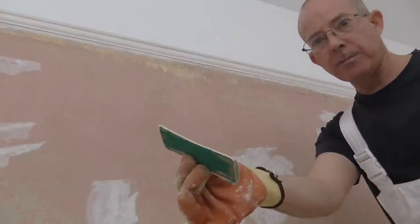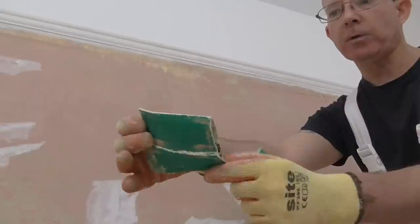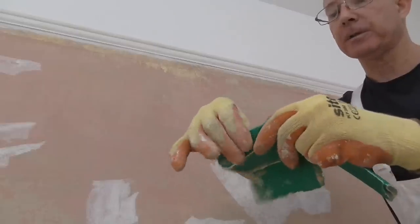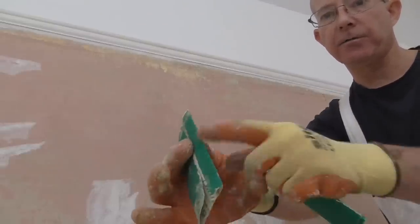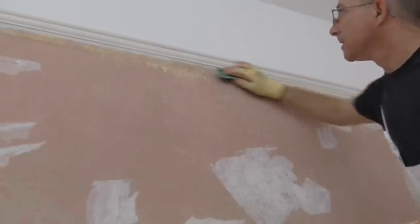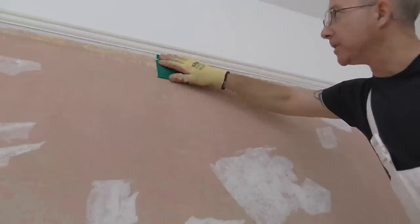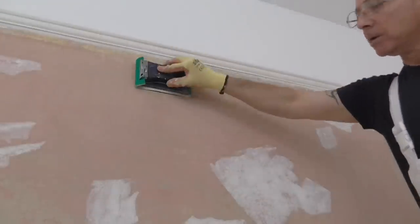I always use a piece of sandpaper and you can see where it has been wearing. Because when it's folding over, I like the sharp edges to get into the corners. So what I do when it starts wearing like that, I'll make another fresh corner and keep working the sandpaper like that until basically there's nothing left in it. So that's the top edge. And then the flat sometimes needs a larger piece of sandpaper — you can have it under the edge there, and then turn to your sanding block to do it in the centre.